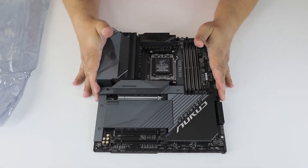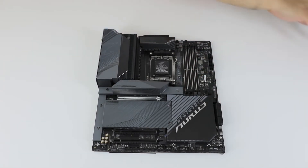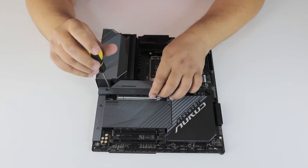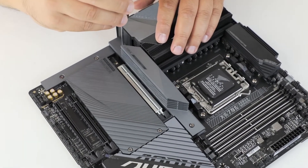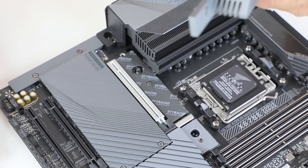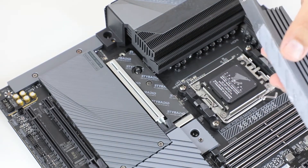The top cooler, despite its small size, has a copper heat pipe to transfer heat to the big radiator, so quite good cooling for the VRM. There is also a massive cover for the topmost M.2 drive, which has PCI Express Gen 5 support. We can expect it will get quite hot during operation, but it's just an aluminum cooler with no heat pipes.